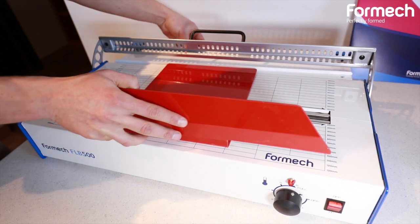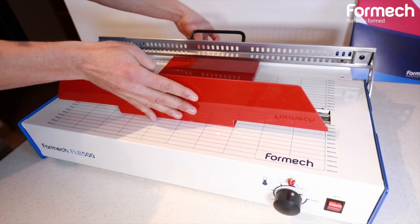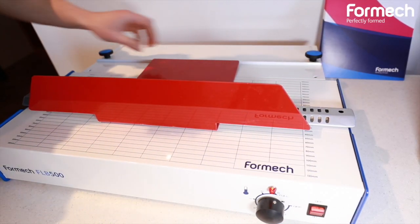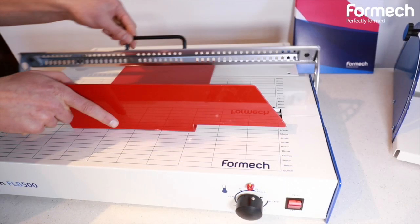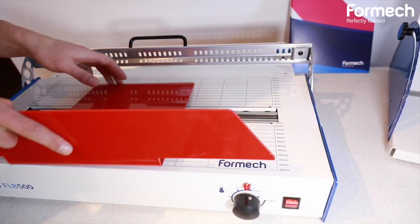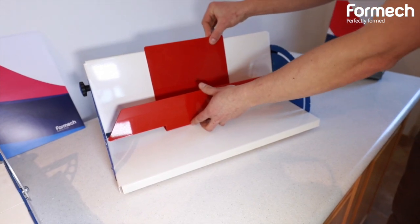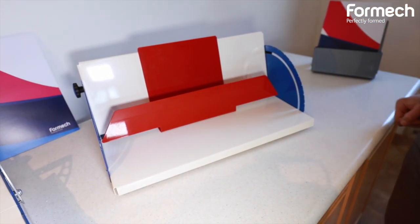Adjust it to our second position. Clamp it down. Place the material clamp in the position. So now the material is soft. Place it on the cooling jig. Hold it there at the 105 degree angle we set earlier and let that cool for a few seconds to a minute.